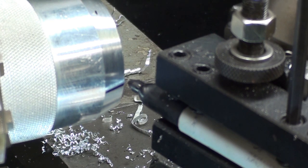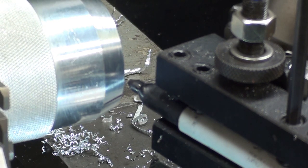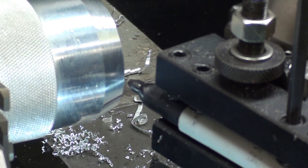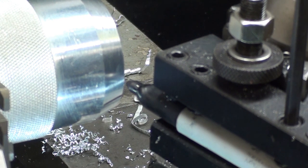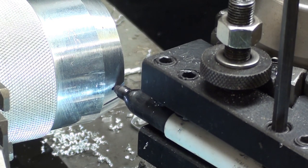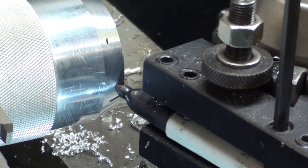And now I'm going to move it, and I have my hands on the dividing head now. One full turn and the 9 holes, and now I'm ready to make the next mark using the compound, and this line will be shorter than the previous one. And now another one. This is a short one also.